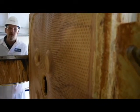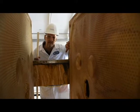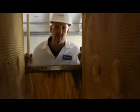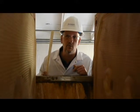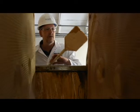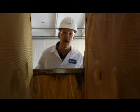What this does is it allows buildup on one side of the press but not the other, because it's easier to clean the operator side. You're going to end up with an uneven plate stack. If you can imagine closing up on a square, it closes fairly easily. If you're closing up on something that's not square, all of a sudden something's going to have to give — and that's going to be your frame. Your frame starts to shift because of the buildup in between each plate, and your press will end up out of square, which leads to all kinds of other issues. Simply keeping that surface clean on both sides of the press is really going to go a long way and make your life a lot easier.